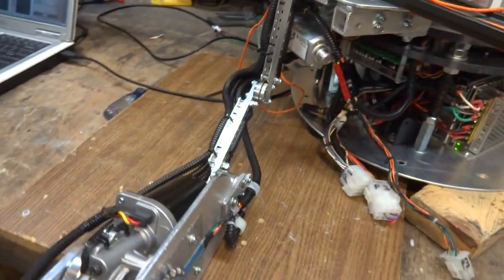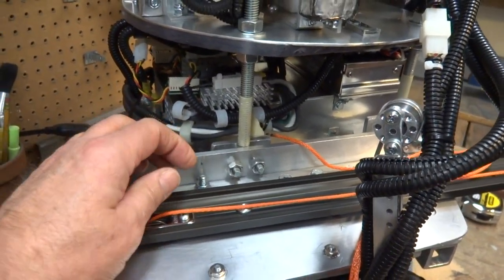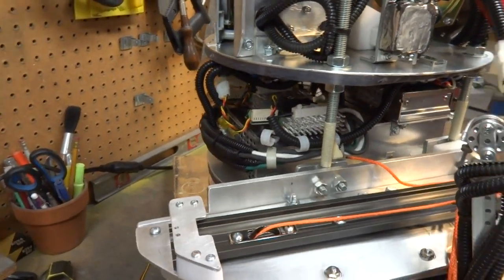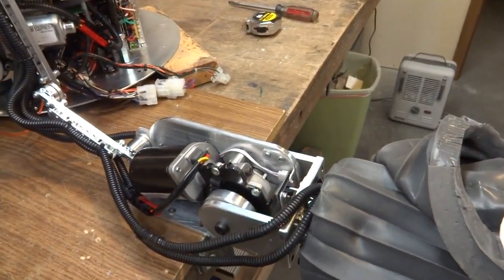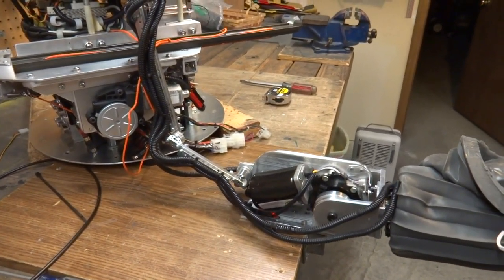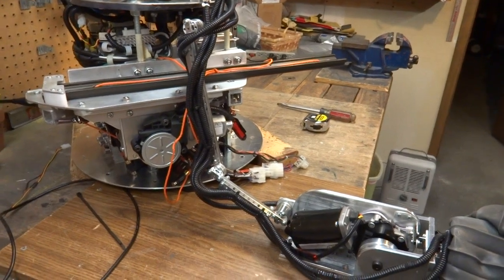I took those out and put 1k resistors in there — I cut out the 10k and soldered in 1k resistors. There's one on the positive leg and one on the grounded leg of that pot, and the center feedback wiper is just floating; it doesn't have a resistor on it. That brought the voltage up going around the SoftPot to about 4.6 volts, giving it a full range of voltage and giving the Kangaroo more headroom to read the voltage change. There's a big difference between finding a swing within 1.6 volts versus 5 volts.